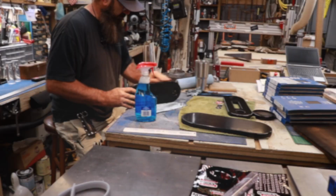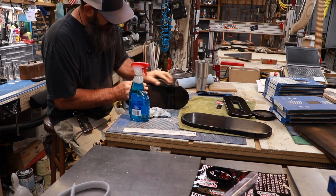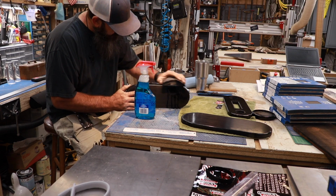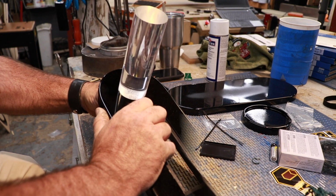They supplied the abrasives on the 2x72 as well as all the sandpaper I used in the project to wet sand this. This was sanded up to 1,000, then 12,000 grit. That's what I'm doing here, just wet sanding. Just painting, sanding, painting, sanding.